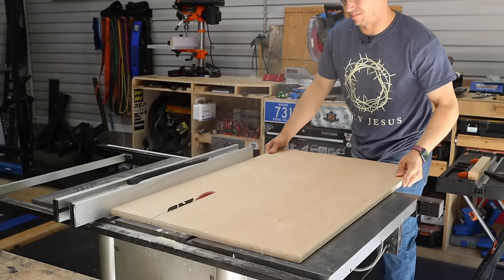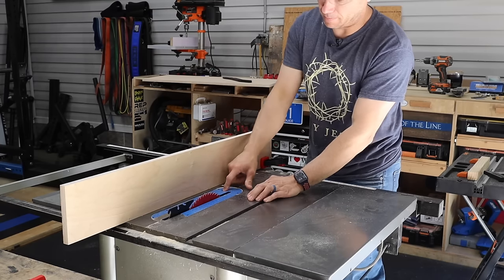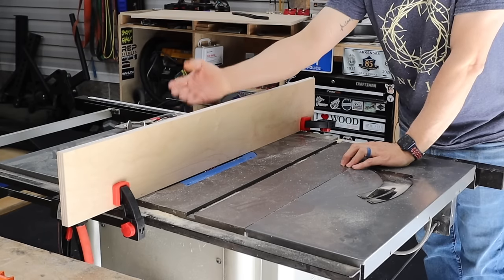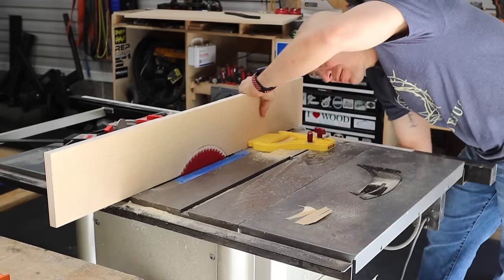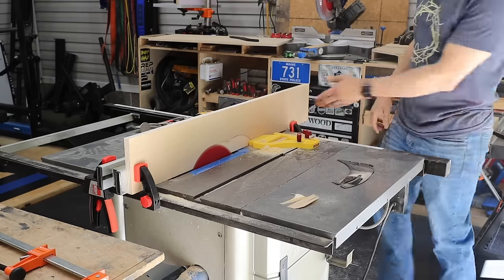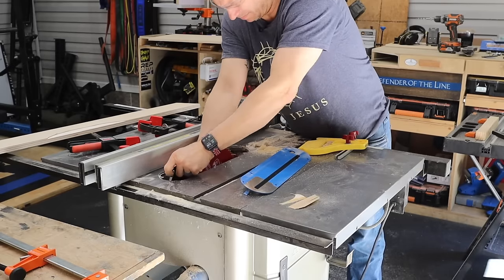I'm going to rip this down to six inches. What I did was mark where the riving knife and the blade is, then clamp this here and move it out of the way. I'm just going to take the riving knife off. I'll turn the saw on and raise the blade up — it's going to make that cut. Then I'll turn the saw off, unclamp it, and move this back until it gets to the riving knife mark. What I did was turn the blade on, raise it up, turn the saw off, lower the blade, move the jig, clamp it back down, then raise the blade back up. Once most of the material was cut out, I slid it back and forth to get any irregularities out of there.